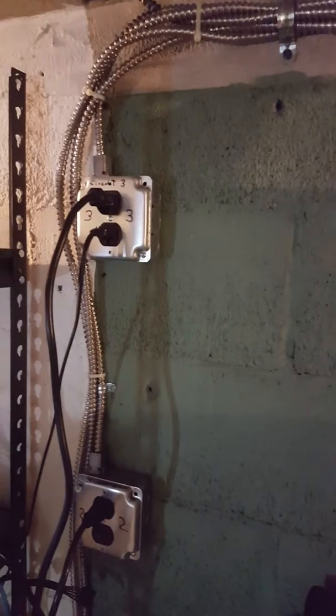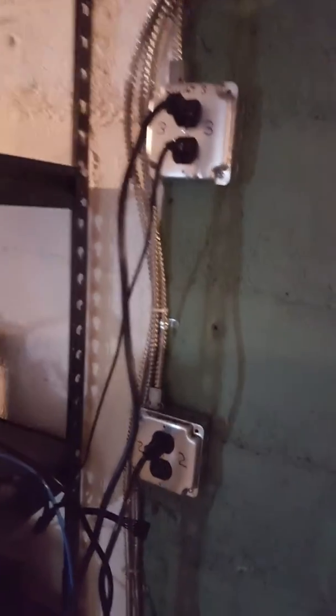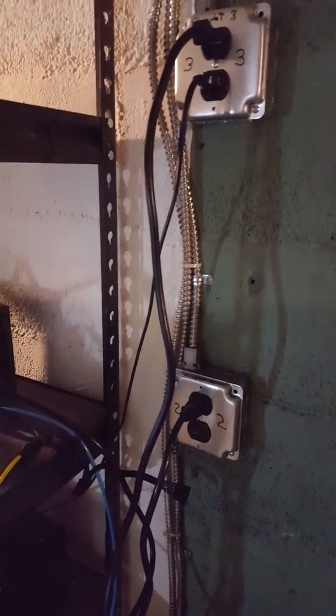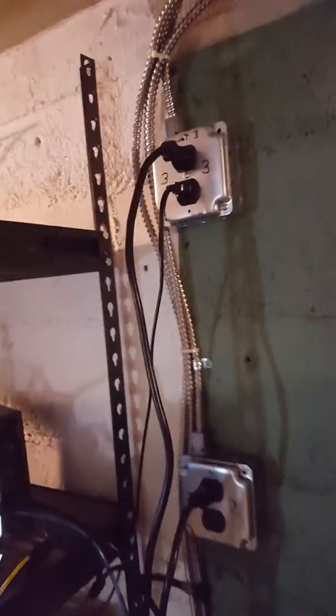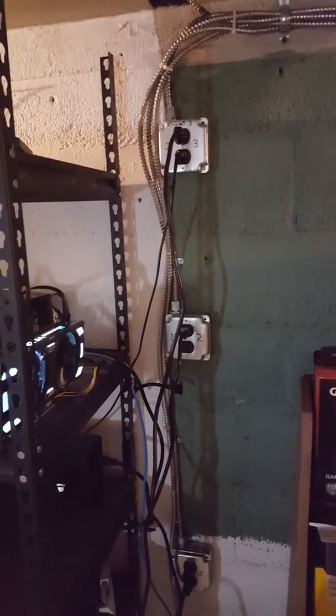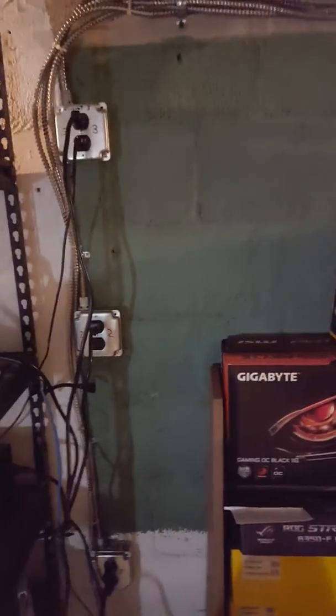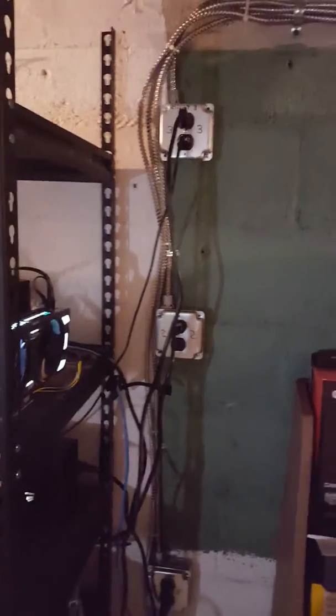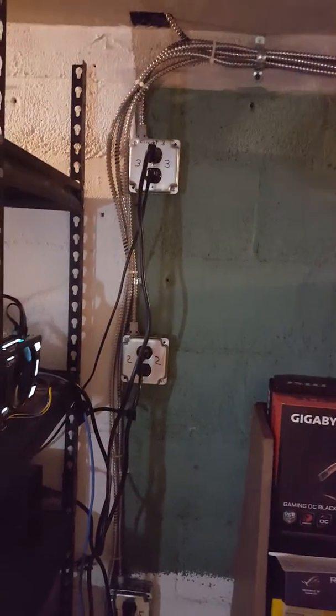Here's an example: each one of these I have with 20-amp breakers going to it. You pull about 16 to 17 amps and you're fine — that gives you easily 1,600 watts off of this no problem, with 1,500 being more comfortable. I watched a video by Vosk Coin on the 80% rule and that's absolutely true. One thing to keep in mind too is you don't want to go too far under — if you're at like 20% draw constantly that's not really good either. Keeping that 80% mark is definitely the goal.